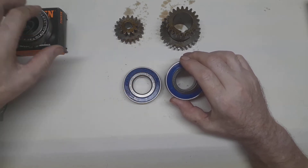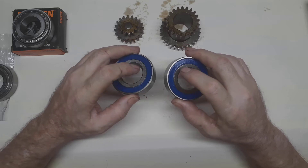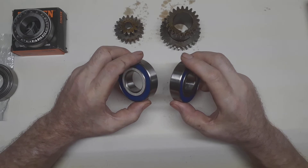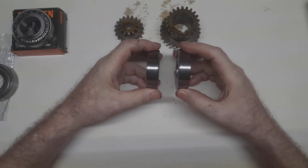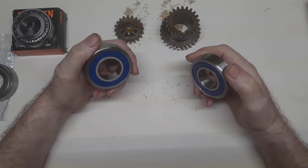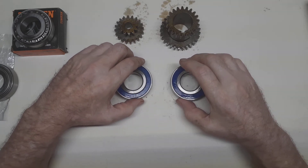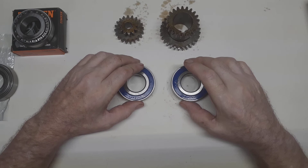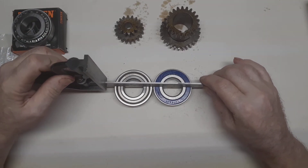You'll notice that these, kind of similarly to the tapered roller bearings, you can see a difference in the inner race. You have a large side of the inner race and a smaller side of the inner race, and this is why they're called angular contact. They need to go with the smaller side toward each other, like this, and the preload holds them together. Just enough, not too much, and that's going to be a matter of feel. I'm going to go with these, which won't need any modifications, because they are exactly the same size as the original.